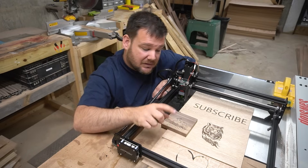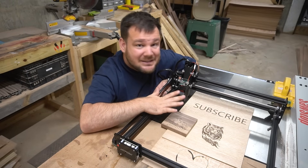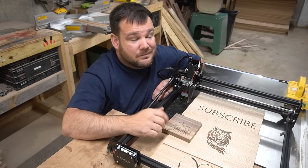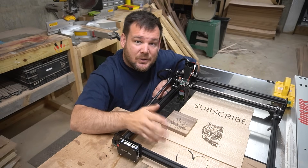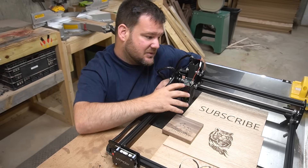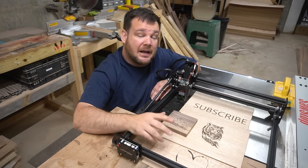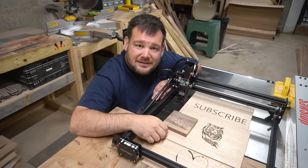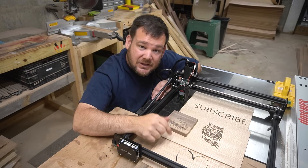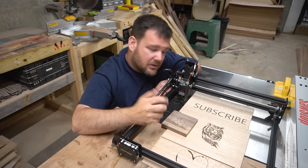Just for engraving though — you're not going to be able to cut anything. Our cutting test didn't go so well, but this is marketed as a laser engraver, not a laser cutter. If you want to engrave things like barcodes, QR codes, simple art, or fun projects for the kids, this is a fantastic option. One thing I'm unable to test is longevity — I'm not sure of the life expectancy of a laser like this. I used it for four or five hours today without any issues. If you're using this at home, make sure you have some ventilation and wear the safety glasses that come with it. I'll have a link to this exact machine on Amazon in the description, and also a link to my CNC router video for a good comparison.